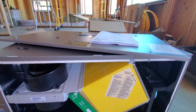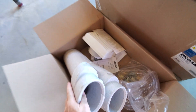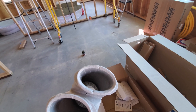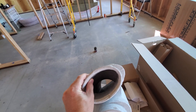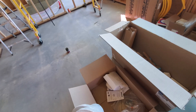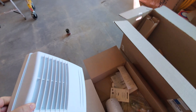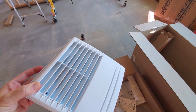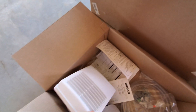The other component of this whole system — other than some ducts — is this concentric vent kit. This is where it goes through the exterior wall. One side is the supply from inside, the other half is the exhaust, and they get combined into a single center tube so there's just a single penetration through the exterior wall. This round part connects to the exterior piece — that's what we'll see outside. The exhaust blows out the top and the intake comes in one side, making it simpler as it goes through the wall.